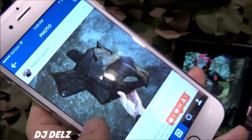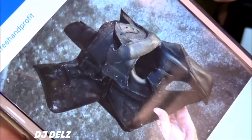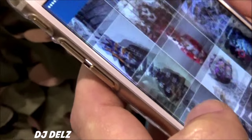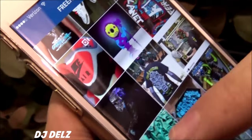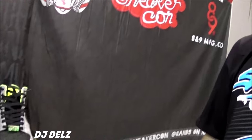This mask right here, the Jordan 1 Black Ostrich Mask — for 104? I've seen that. That's being cast right now so that I can cast it in resin, and people can get them. You see here, it's got the vents for the molding. We put extra silicone in there to help fill up the extra space, pour the liquid over it — that makes a silicone mold. And there we start casting the two-part plastic and resin in different effects: glow-in-the-dark, black light, metallic. It's gonna be crazy, it's gonna be wild.